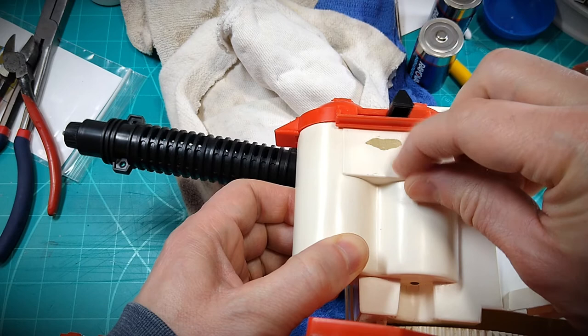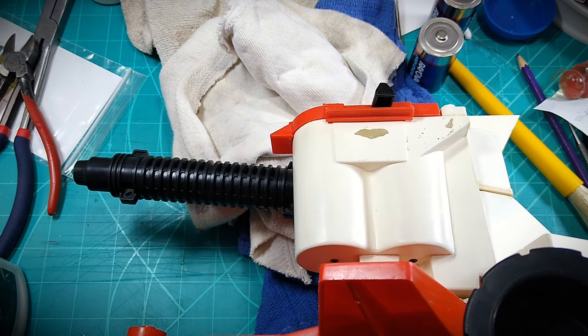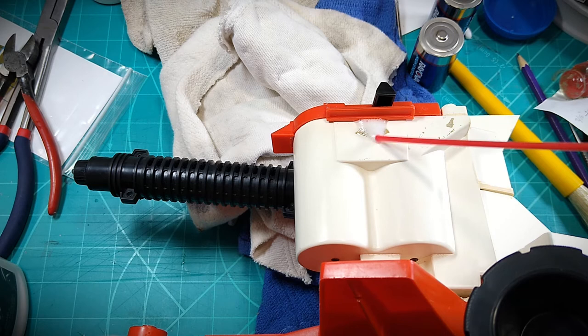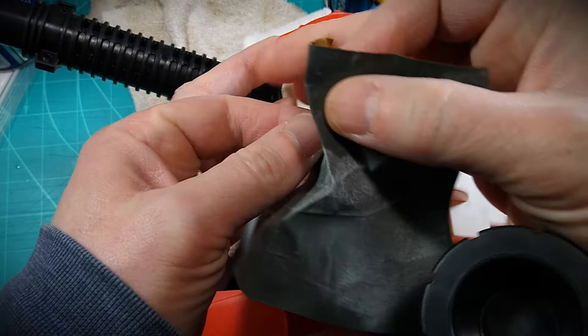The decal had old decal adhesive stuck on it. Even though the decal was loose, it's formed like a rock-hard fossilized debris on there, like it's bonded onto the plastic. Sprays to loosen it aren't really working to get that spot to budge, so I'm using some fine 3000-grit sandpaper on there to buff it off. Then as I originally planned, I'll go over those spots more with the plastic cleaner.